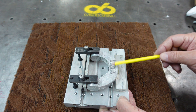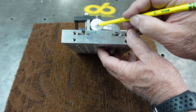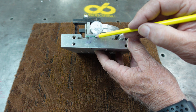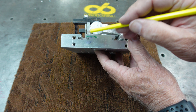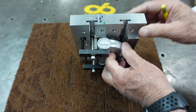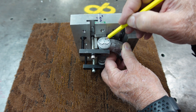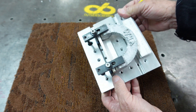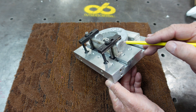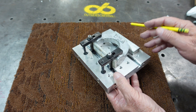This face will get dusted off right here — get rid of the backwards ARW. You can see the little green dot here; if I drill center, I'll have the ability to move from that point over on the Y, then move on the X to the next point, and I know where that point is. When I turn it over, I can use the same coordinates, move back over from that point on the X, and pick up the center. My plan is to drill all the way through this unit — maybe a quarter inch — so I can put a quarter-inch rod through it for measuring.